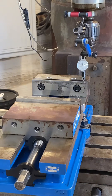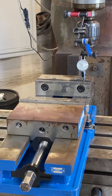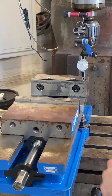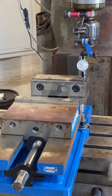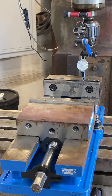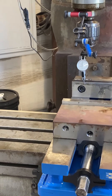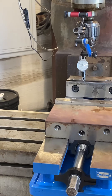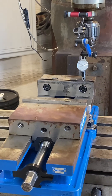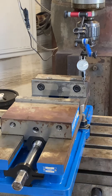The first thing I do is move the dial on the dial test indicator to zero about midway in its full travel. I travel one way and then back — as you can see I only got a couple inches down and I was out quite a bit, so I go ahead and make an adjustment to what I think is relatively close. Moving that little bit got me within six or seven thousandths. I travel down and back so I know exactly which way the needle needs to move, and I tap the vise in that direction.